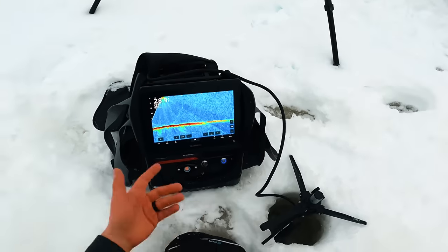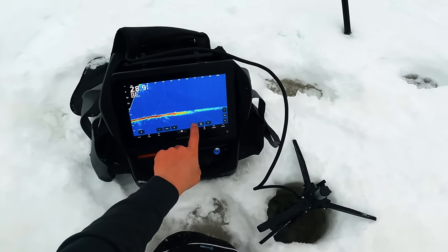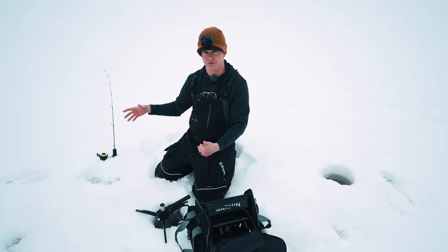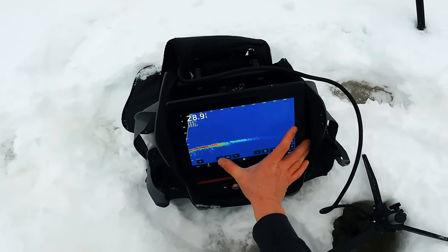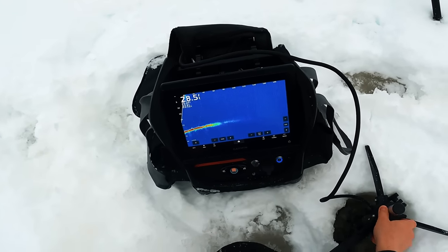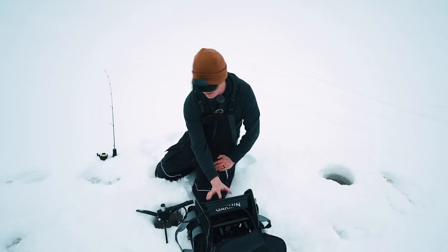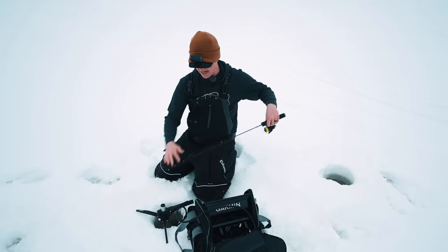Then what I'm changing is gain. As you crank the gain up, it's exactly that — it's sensitivity. In deeper water you might need to bump it up a little bit more. Most of the time my gain is in that 60 to 75 range, but when I'm looking for fish, maybe I want to keep it a little noisier — I'll go around 75 and then search. Since switching to the LVS 34, the new transducer, I definitely search further. I used to search around 100 feet away. Now with this new transducer, depending on depth, I can still see fish. Right now if you look at 120 feet, you can see there's a crappie 120 feet away. I have no problem seeing fish 140, 150 feet away. There are two crappies 80 feet away — what I could do right now is go drill 80 feet away and be right on top of those fish.